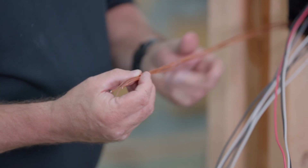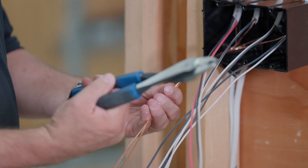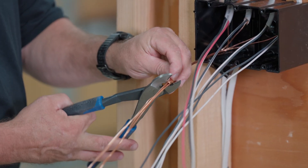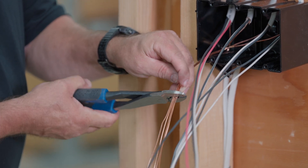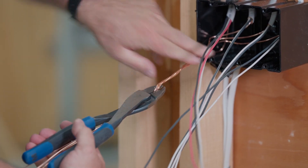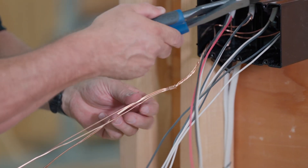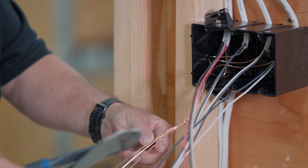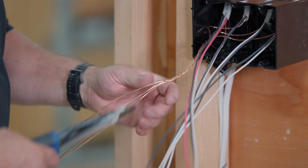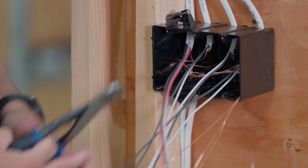You can have up to five number 14s on the ground crimp. Then we take a crimping tool and crimp the wire right into the crimp. After crimping, we twist these wires together. Now we have three switches, so we need a ground wire for each switch, and we have four wires coming out. We'll clip one of them off so that we have three wires for our switches, then push the crimped bundle to the back of the box.